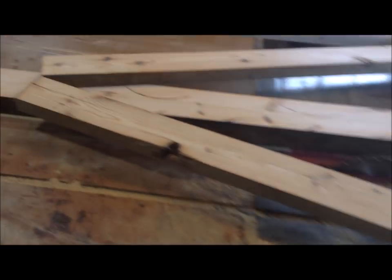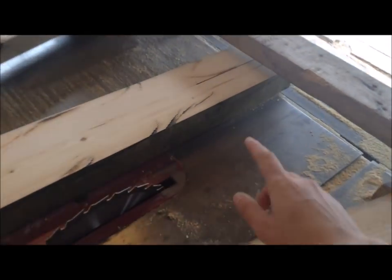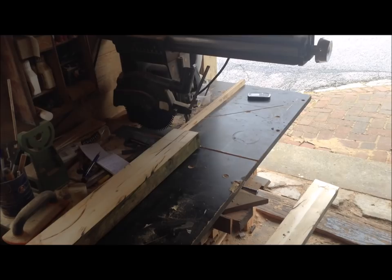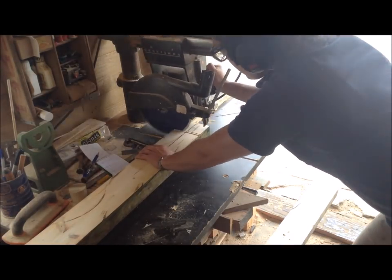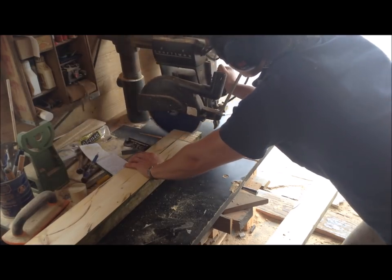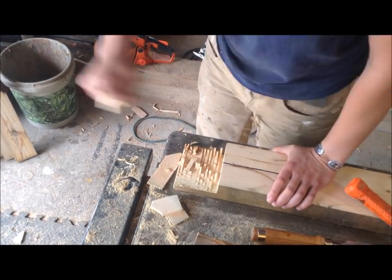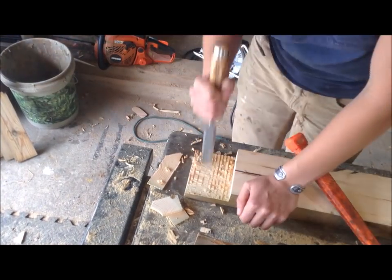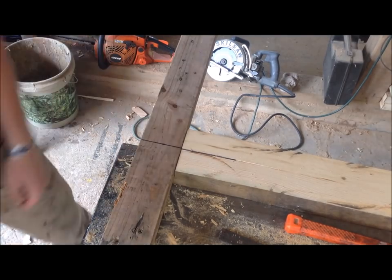You can see from the way this is set up, if you wanted to, you could attach this with butt joints. I chose to use half laps because it's going to be holding up weight and kids are using it. I marked center on my two bottoms — that was going to be the first cut. On that base, I'm just going to cut off the thickness of that two by four at the bottom. On my radial arm saw, I raised the blade to get that perfect halfway-through mark, made a bunch of kerf cuts, then chiseled out the excess. That's the easiest way for me to make laps on the radial arm saw, and even removing the excess goes by fast.